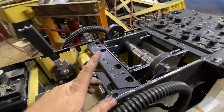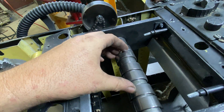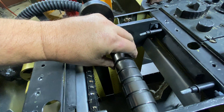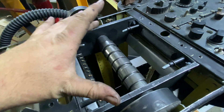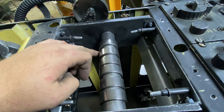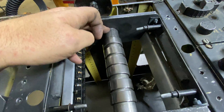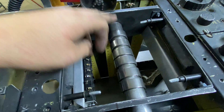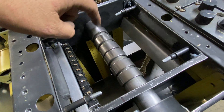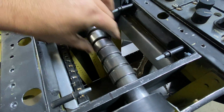I got these B112 bearings. These are actual parts from the B36 — not vintage parts, but the exact parts they used. The inside diameter is one and three-eighths of an inch. I knew the quadrant shaft was one and three-eighths outside diameter, and these bearings are one and five-eighths outside diameter, so I can make the sheaves based on this — they probably just slide on here.